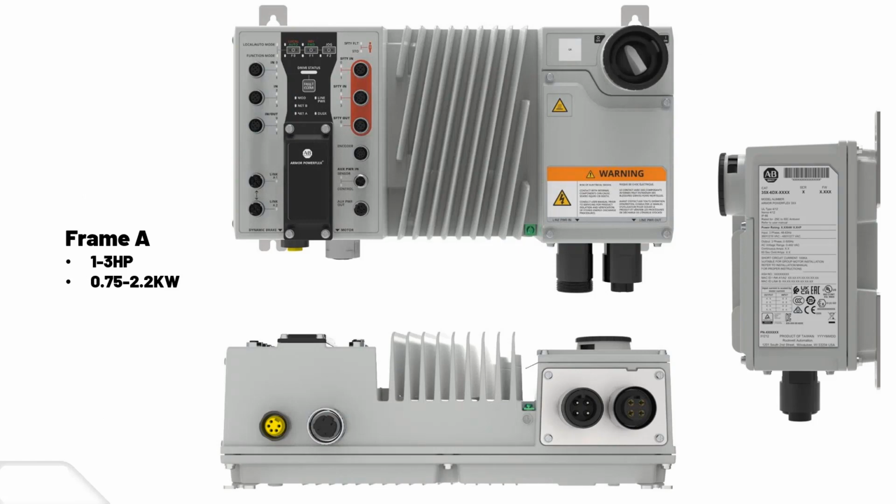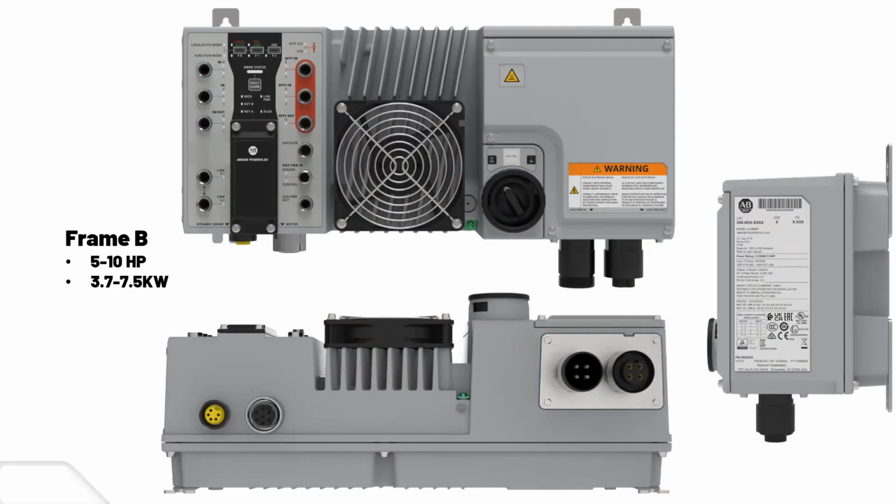There's a picture of the frame A drive. Everything you see there: the quick connects, the disconnect, the connections, the heatsink design, and the connections on the bottom. With frame B, you'll start to see a little bit of a difference. There's a heatsink fan mounted on the front, which is obviously good for the environments it's going to be sitting in. There's a little bit different placement of some of the devices, like the disconnect. It's just getting a little bit bigger to cover that horsepower range.